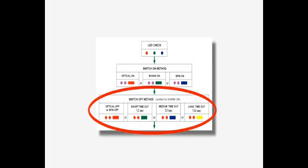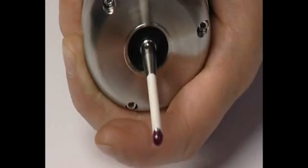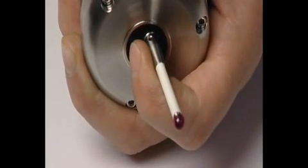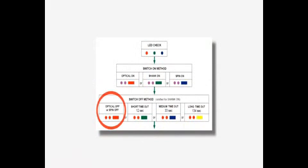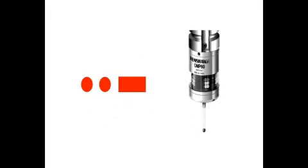The OMP60 has multiple switch-off methods. To change the switch-off method, deflect the stylus for 1 second. The switch-off methods are red, red, red, optical or spin off, in which the OMP60 will accept an optical M-code signal or a spin-off command at the speed stated in the user guide for between 1 and 6 seconds.